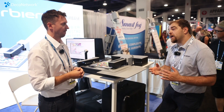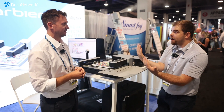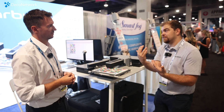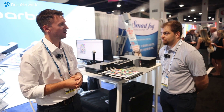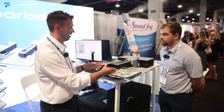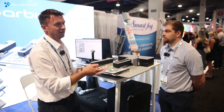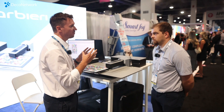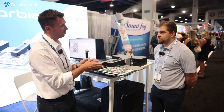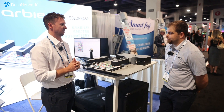You should be testing it every once in a while to compare — when we dialed it in the first time, are we still hitting those exact same colors today? And as we know, many customers come in with a sample and say they want this, then come back a year later wanting the exact same print. To achieve that, you need to be very well aware of what your printer can do, and you need to measure — in order to prove that the color you want to hit is one you can still hit today.